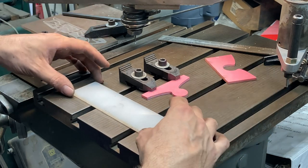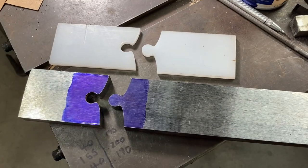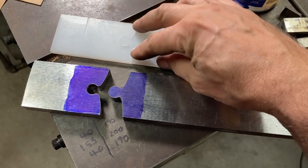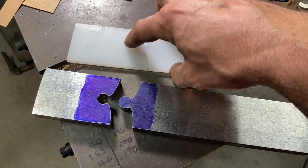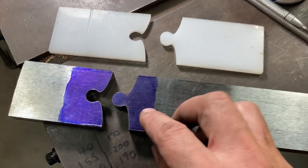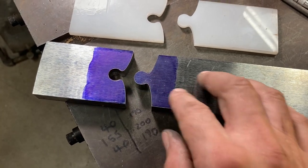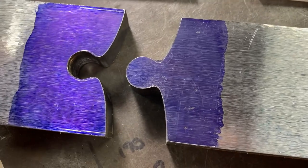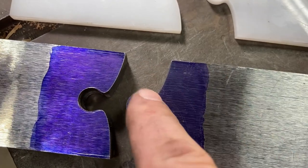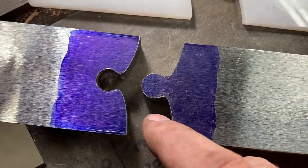And yeah, hopefully we just managed to cut all the steel without snapping a bunch of cutters. I had cut a proof of the pattern with the pantograph. What's handy about that too is that now I have some very nice scribing templates to scribe the pattern roughly onto the Damascus here. And you can see I've drilled a hole here, drilled a smaller hole, and then just bandsawed up to and ground up to the line, but haven't fully taken the line anywhere.